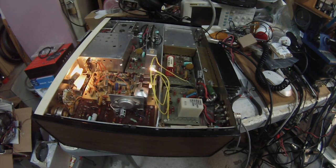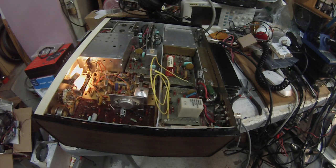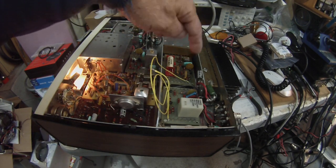Allison said getting that light out of there is kind of tough because you've got to take the panel off, and it's a pain. She suggested following on circuits — by the way, this SWR/ALC board appears in a lot of TenTec transceivers built subsequently. In later rigs they changed the incandescent light to an LED, which would be much less likely to fail unless there was a catastrophic failure. But this rig is about 50 years old, so that incandescent has had a lot of flashing and finally succumbed.